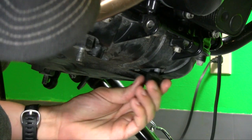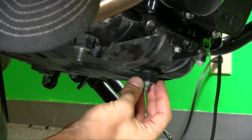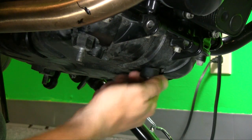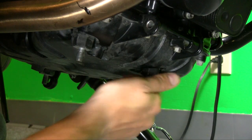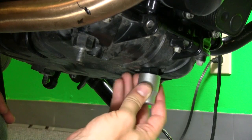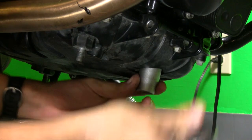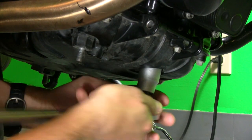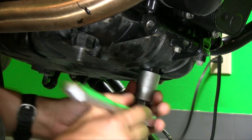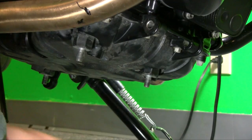Go ahead and install the vibration isolation mounts on the sump of your motor. You'll see that there are four mount positions — they're pretty obvious when you're looking at it. Finger tighten them first, then taking a 21 millimeter socket, ensure you get as good a bite as possible by putting the socket all the way over the vibration isolation mount before attaching your ratchet. If you don't have a 21 millimeter deep socket, put the socket on first and then insert the ratchet as deep as you can and give it a little torque. You're not cranking down on these — as soon as you see the rubber start to twist, you're done.